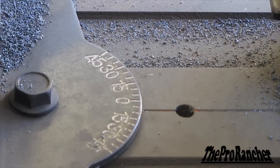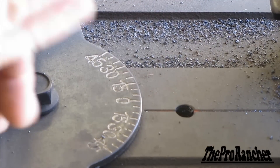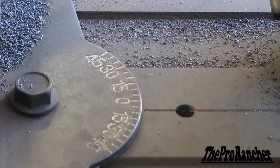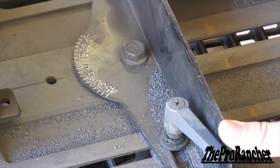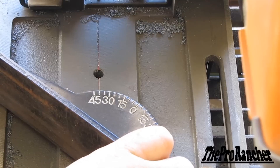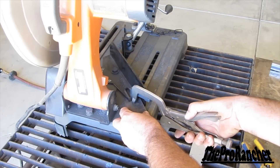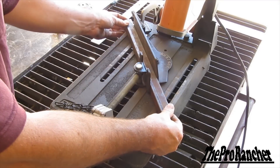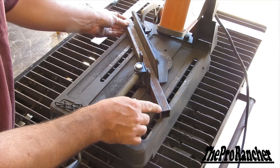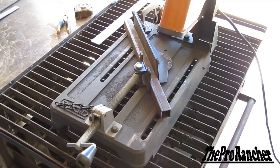To get started with our 45-degree cuts, we have to adjust our vise. Right now it's set up as a 90-degree connection, meaning the blade is perpendicular to the piece. We need to turn it to an angle so we get a 45-degree cut. To adjust the vise, we unlock it, move it out of the way, and slide it over until the 45 mark lines up with the red line. I like to make double sure it's locked down using vise grips. Then we place our piece in the vise, position the corner slightly past the slot, crank it down, and go ahead and make our cut.